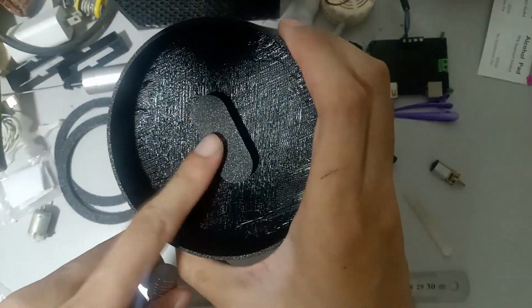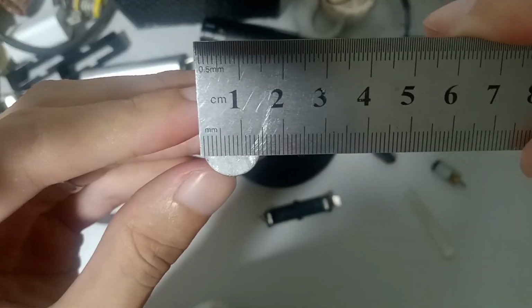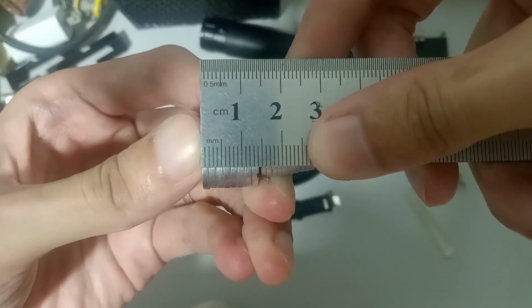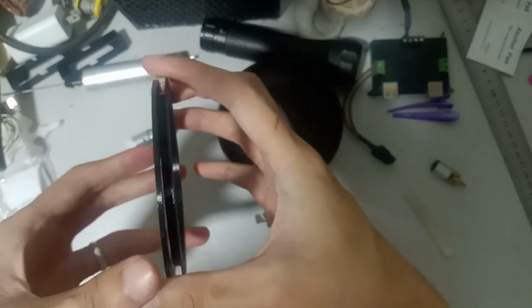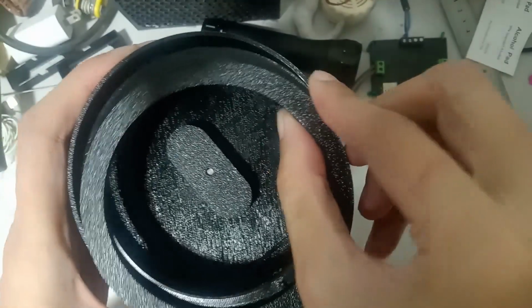For the propeller that's attached to the motor, inside has a total of 6 magnets. Each side has 3 magnets stacked together. The magnets dimension used in this project is 14 by 1.5 mm. Then mount them to the shaft of the motor. Make sure that the propeller doesn't have any friction against the main case.